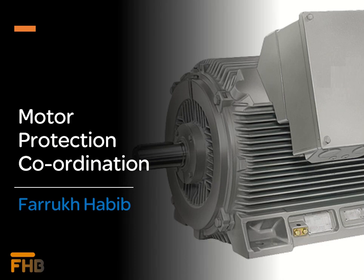Hello viewers, welcome back. In today's video, we will discuss the protection coordination schemes used in low voltage motor starters for industrial motors in case of a short circuit fault. These protection schemes are characterized as Type 1 and Type 2 coordination by the IEC. In the first part of the video, we will understand the difference between these coordination schemes as per the criteria defined by the IEC, and in the next part, we will see which scheme is better for industrial applications.